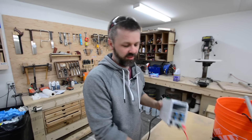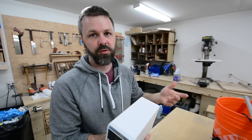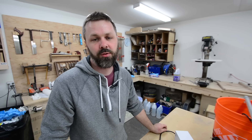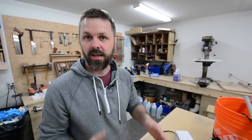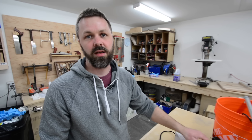A quick note about power supplies. I picked up this one on Amazon - it was about 80 bucks and only goes up to about 5 amps, but that's plenty for the parts I use. A lot of people just use battery chargers, but with those you really lack the control. You should be setting your amperage based on how much surface area your part has. Caswell says 4.5 amps per square foot, which is about 0.03 amps per square inch. If you're a little low on amperage, the part's going to take on more dye but not be quite as hard or durable. If you put too many amps in, you get a really hard anodized surface but it won't take dye as well. For me, dye is more important, so I stay a little on the light side at about 0.02 amps per square inch - that seems to give me the best balance of dye uptake while still giving a durable surface.